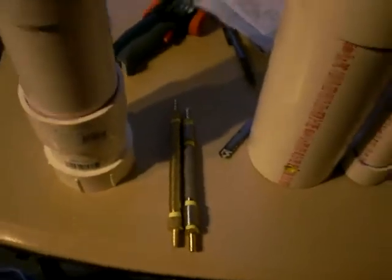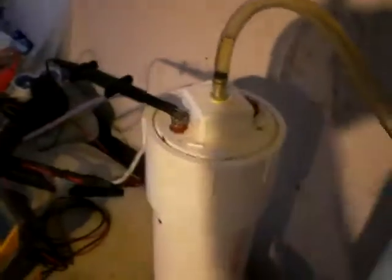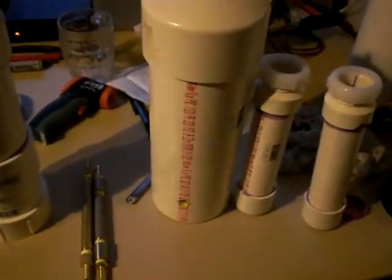So I've got bubblers, I've got flash arresters, and I've got upside-down cells. This one is in fact working like an upside-down cell, except the cap and connections are on the top — that's the only reason I don't call it upside-down. This new one is going to be a true upside-down cell. Everything's going to attach from the bottom side, and it's going to have a rubber cap on the bottom so if I ever need to tear it apart I can get to it. If I take it out and turn it upside-down, I have access to everything.